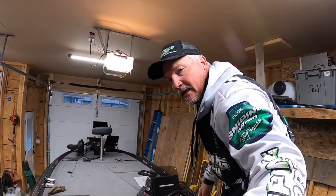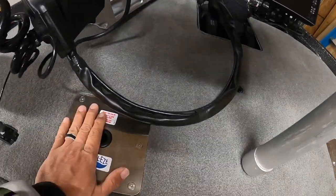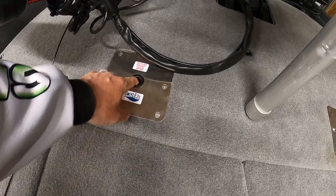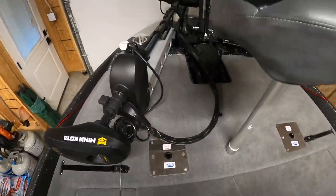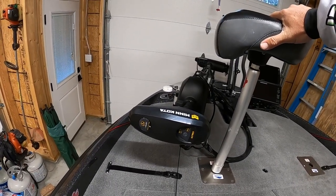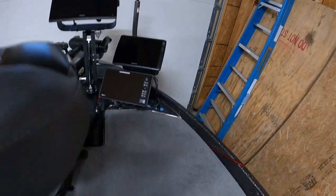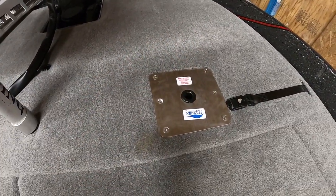Let me walk you through — this is just about the mounts, some of the stuff that Cornfield Crappie Gear did. This is not about the electronics and everything else that went in on this boat. So first and foremost, I went ahead and did the pedestal seat holes. They're reinforced underneath the deck, which is really nice. Now, a lot of people knew that if I did something here, I was going to have to take the pedestal out every time I used the trolling motor. So this is actually only 12 inches from here to there. That will allow it to slide past the seat when it's on its side — yes, it looks like it will slide past it right there. If it doesn't, I'll have to remove the seat, but it looks like it will because there's some give on that cushion. This one, on the other hand, is 16 inches off the side — that gets it as far away as possible, giving that angler all the room needed on that side.